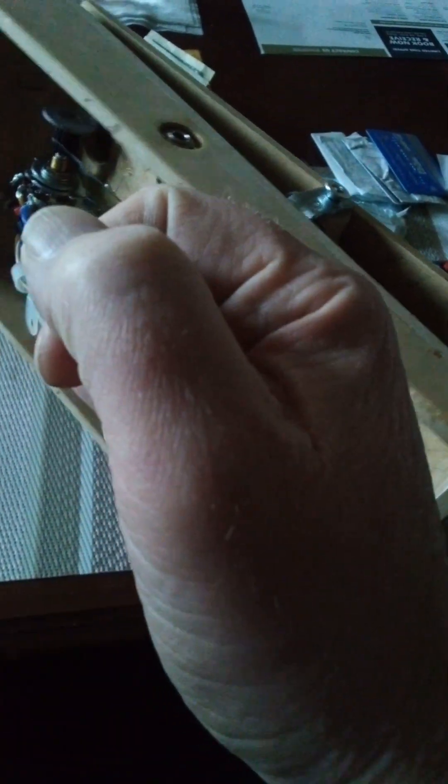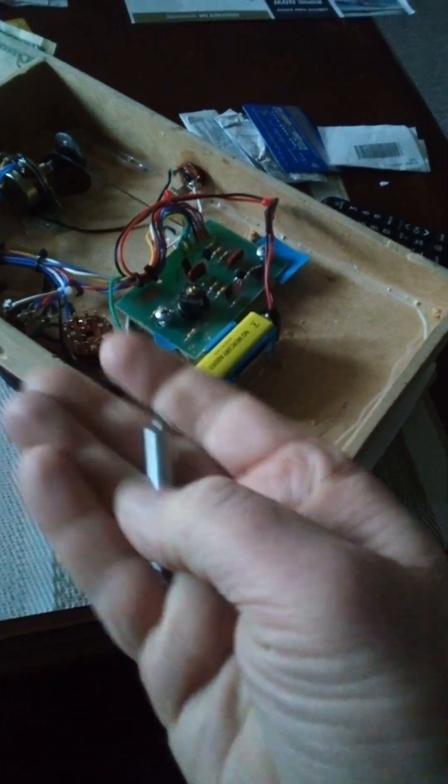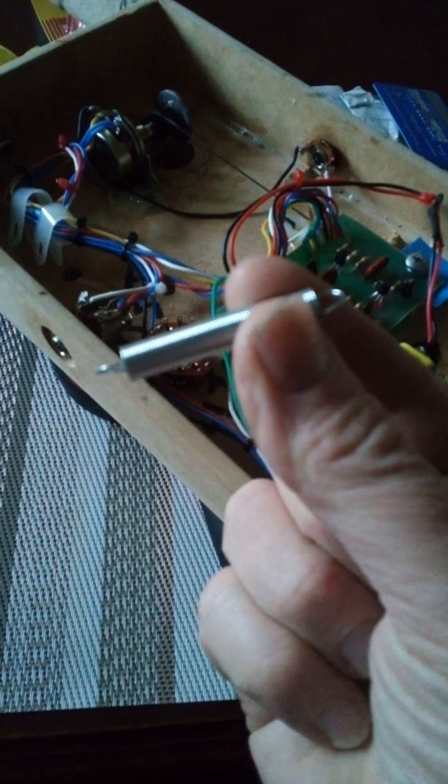It's dark in there — I'm going to tilt it toward the light. I had that spring in there which has quite a heavy tension to it, and I want to put a spring on both ends obviously so that I can cock the treadle and leave it where I put it. So I went to the hardware store rather than order online and I got a similar size spring, but as you can see this one is way softer.